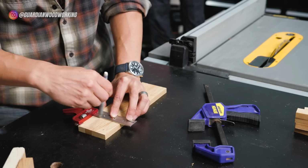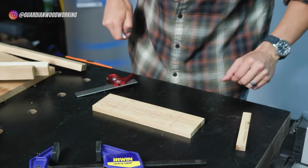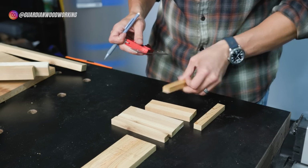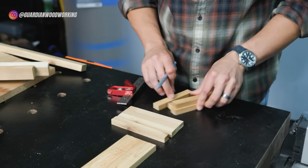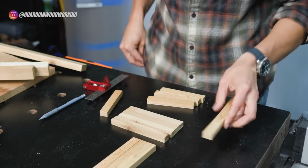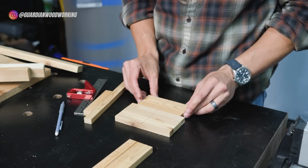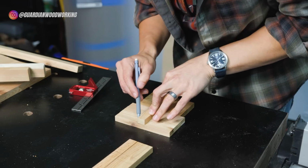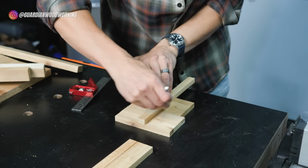So now it was time to make all the marks for the half laps I was going to cut with the table saw. I just took my mini combo square here. I have all the exact measurements in the plans in the description below, so you can check those out if you're building this along with the video. But I did my best to line them all up, mark them uniformly so that everything was square, and it was going to look very symmetrical when it was inside of the lantern. Because if you're going to build something, you might as well build it pretty.